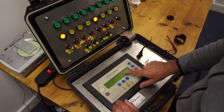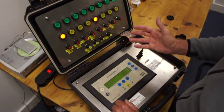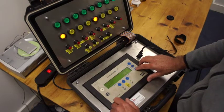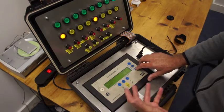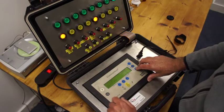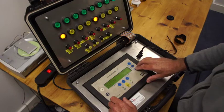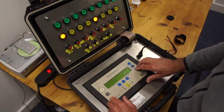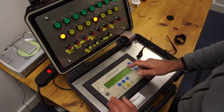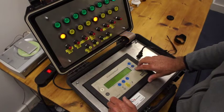It's showing the air filter DP which is normal, oil pressure normal at 2.6–2.7 bar. Press the arrow down again and you move to intercooler pressure, which I've set at a normal pressure of 2.1 bar, compressor outlet 45°C. Element 1 outlet — that's the LP outlet — is at 172°C, again fine, a little bit cool, which I can adjust. Element 2 inlet is 35–40°C, quite normal after the intercooler.